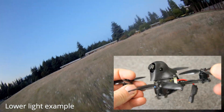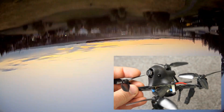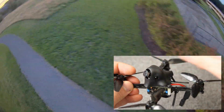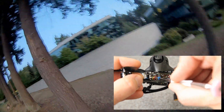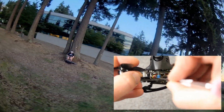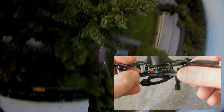Here you can see it all put together in the Beta FPV HX 115 HD. The camera is here — this canopy was originally designed for the EOS 2, but this camera is the same size so it mounts right in. The DVR board is right here, mounted above the all-in-one flight controller with nylon standoffs. That's pretty cool because this same kind of mounting is going to work for a lot of different builds that use these all-in-one boards, though it won't work for every build.